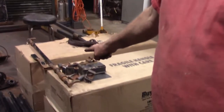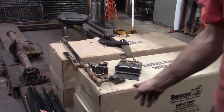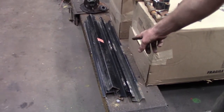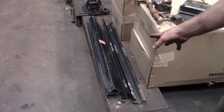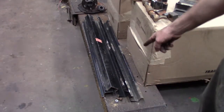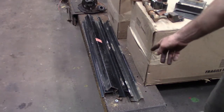The other thing I did tonight, take advantage of a little bit of cooler temperatures, was I managed to trim all of the hardware off of the tailgate. The closing mechanism, the hinges, the latch. Got that done, and also these are vertical supports out of all the stuff that was bent up and twisted. These vertical supports ended up being fairly straight, so I may use those as uprights when I make the new tailgate. The old tailgates were, you know, barn doors, and they got all twisted and bent, so I'm trying to make stuff out of box tubing that the perimeter of it is very strong, and these will merely be to prevent the expanded metal mesh from bending too far. So there'll be two of those vertical supports in each tailgate.